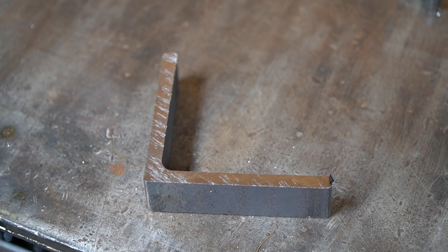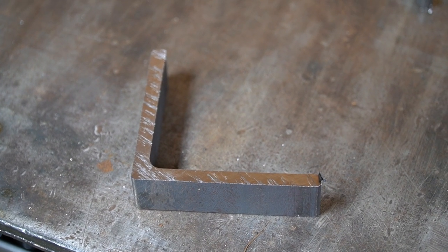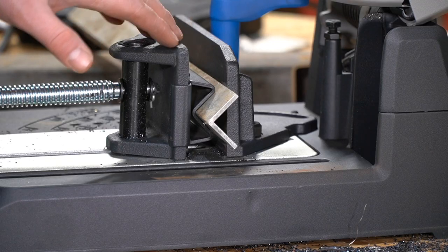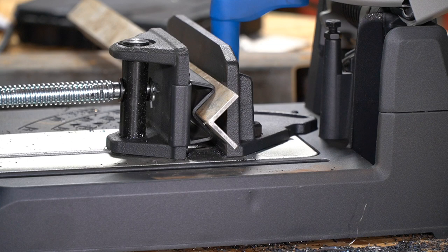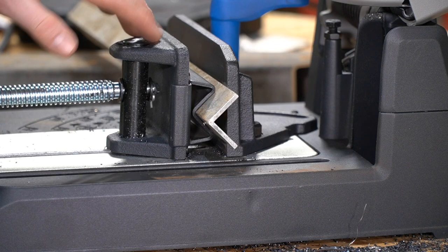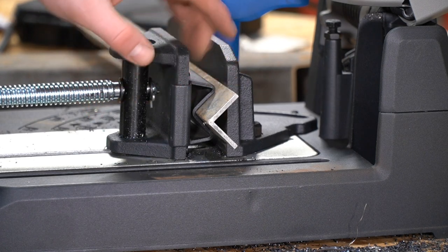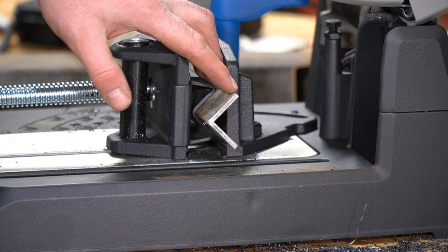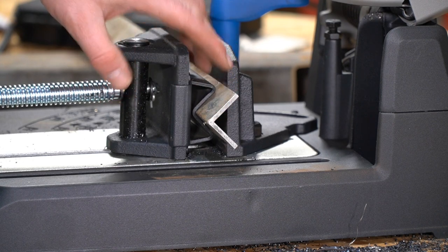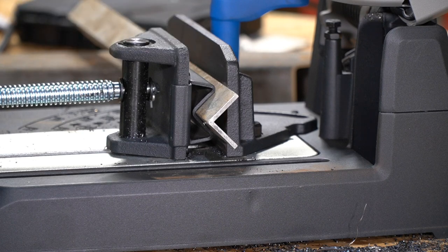Here's a close-up of that very same piece I just cut off — I wanted you to see how clean of a cut that saw actually makes. I also wanted to emphasize that since this is not an abrasive wheel but actually a standard blade, you can cut aluminum with it and it doesn't gum up like what happens when you try to grind or cut aluminum with an abrasive wheel. So what we have in here is about an inch and a quarter — it's a little thicker than an eighth, not a standard piece of metal, but it is aluminum. We're going to cut right through it.